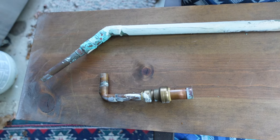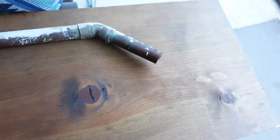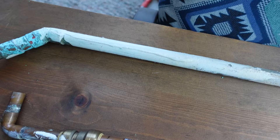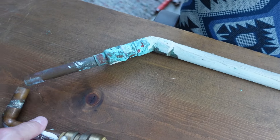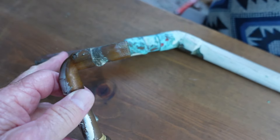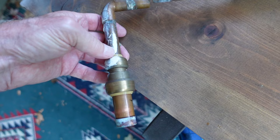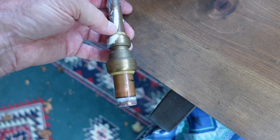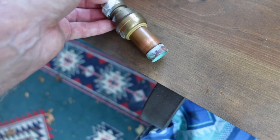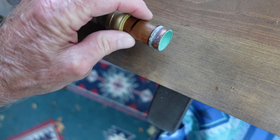I'd like to show you what I ran into on upgrading a water heater. This was a three-quarter inch piece of copper coming from the water softener on its way to the water heater. You can see where it constricts down — goes from three-quarter inch to half inch, makes the bend, goes from half inch to three-quarter inch. There's an 18-year-old Cash Acme SharkBite, and back to three-quarter, and then here they had one of the newer push-to-connect water heater supply lines on it.